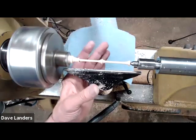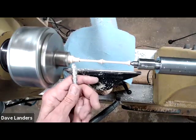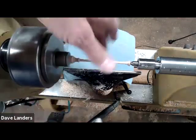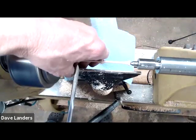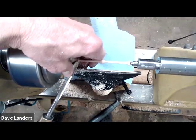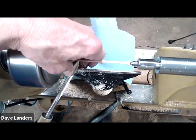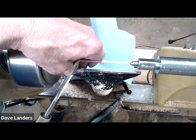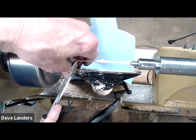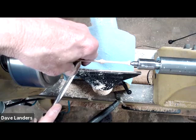Here I'm working, so I can't really grab like this because, that hurts. So sometimes I'll grab overhand. Same kind of a deal, but come in from the top, I get that contact. I can stay clear of the spinning chuck this way. I'm just trying to inch up, well, not inch, sneak up on this spindle's diameter.